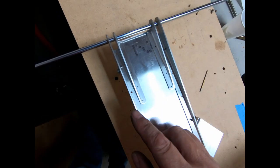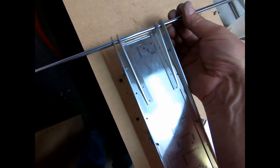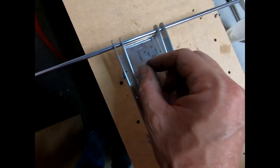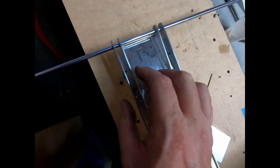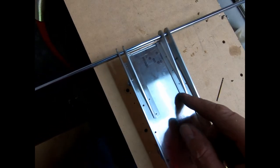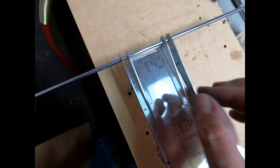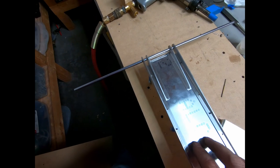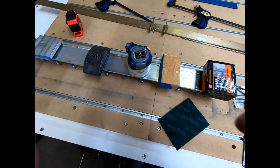With the outside caps now drilled and temporarily held in place, I simply am just going to put a rod through here. I put these inner ones in, and I'll just line those up in parallel with the ones next to it, and we'll just final drill all of the last remaining holes for these inside ones. And once that is done, I believe we're at a point now where we can go ahead and glue all this together. I glued these caps onto this web.